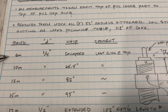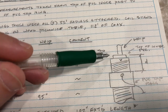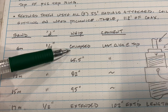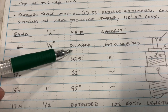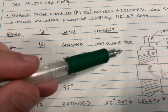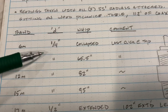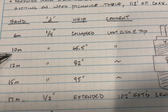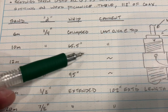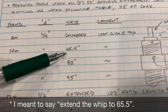Let's start at the top with the 6-meter band. I found that a quarter-inch distance between the mark and the top of the coil, with the whip fully collapsed, corresponds to basically the last little click at the top — right between the first and second coils. That setting tuned up pretty good on 6 meters. For 10 meters, leave the ring in the same spot at the last click at the top and close your whip down slightly to 65 and a half inches long.